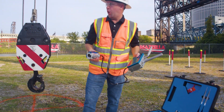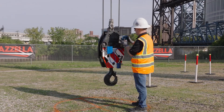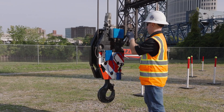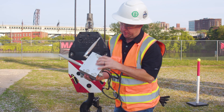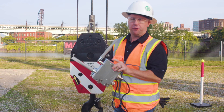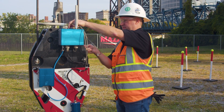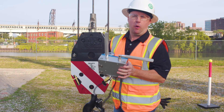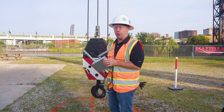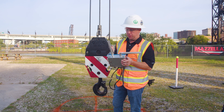So now with these two components, I'm going to go over to the crane block. The best practice for installation is to mount the transmitter at the highest point on the block possible. We have four very strong heavy-duty magnets, which will be the primary system to mount this, but we also have a secondary lanyard system that I'll connect as well, because obviously we want to operate safely.